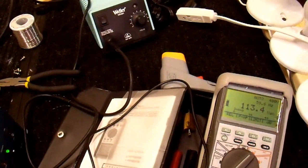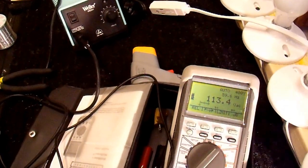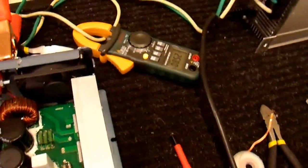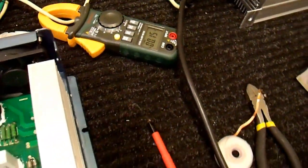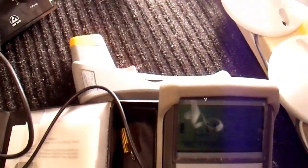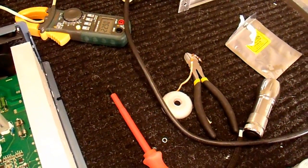A 40-watt light bulb draws 4 amps. Now trying the 100-watt light bulb that fried it last time — drawing 8 amps. Very good. Let's try a couple of light bulbs now: 15 amps with three lights. Voltage is nice and steady. 22 amps.